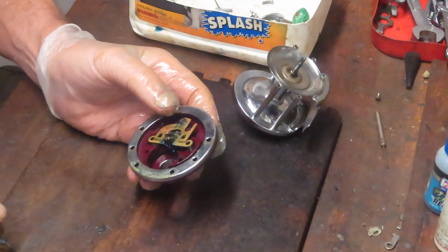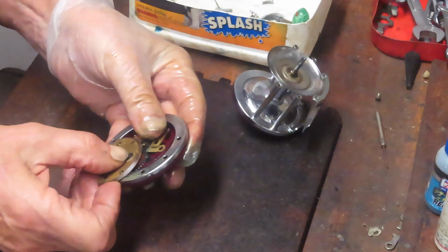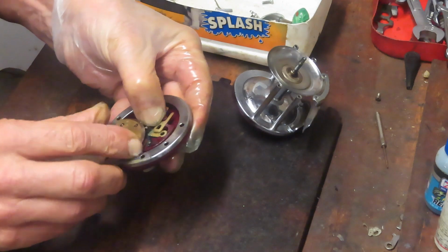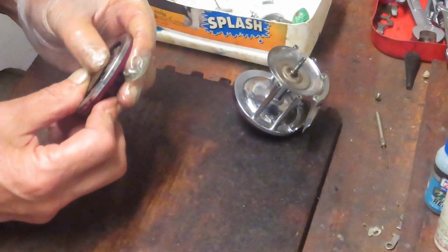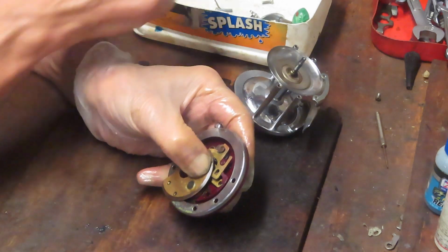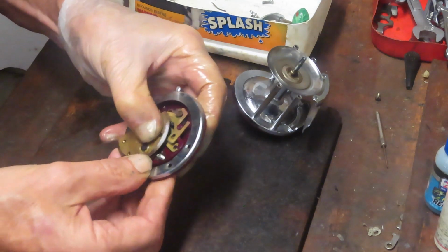When you take the bridge, you're going to insert the bridge from the bottom, and you're going to turn it so that you cover that pinion gear like that. Keep it pressed down. Find a fully threaded screw. That's a bottom screw. That goes in here next.